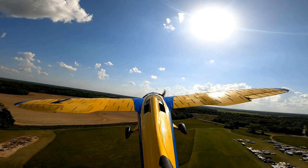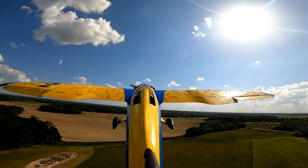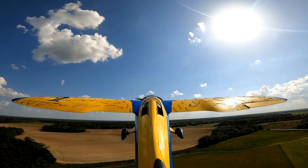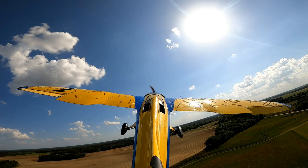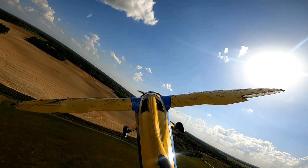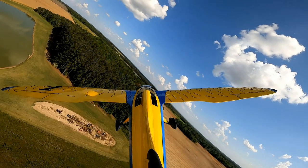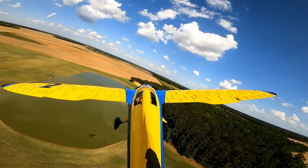This is my third stall of the day, slowed way down. Watch — I'm testing to see that I still have a lot of aileron control while the wing starts to stop flying. The inboard does start to stop flying first, but I've got most of this wing stalled right here and I still have aileron input. This wing, having that inherent almost-washout effect at the outboard third, was really interesting. Here I pull a really hard left turn to see if I can get it to stall and roll on its back — and I can't. Even though much of the left wing is stalled, the right wing isn't, and the outboard of the left wing where section two is was still flying.